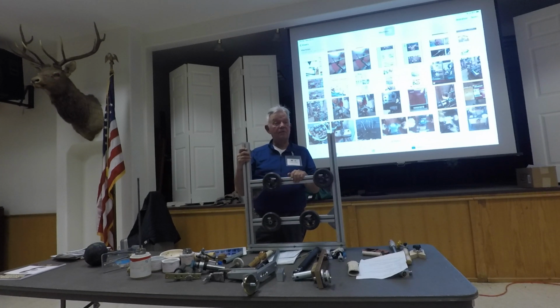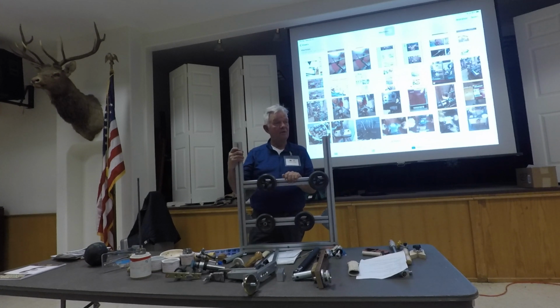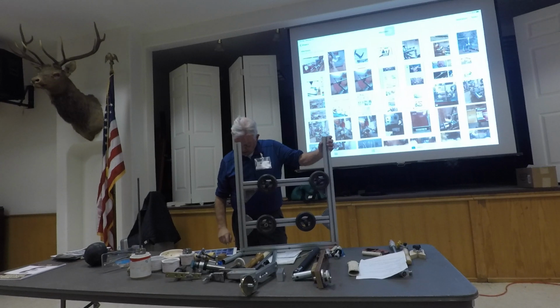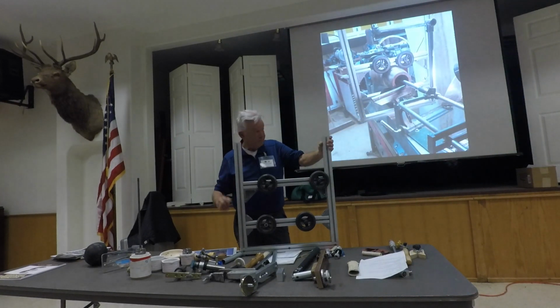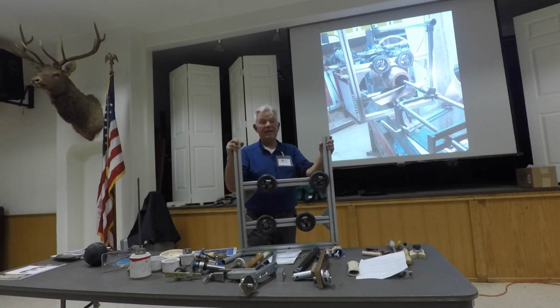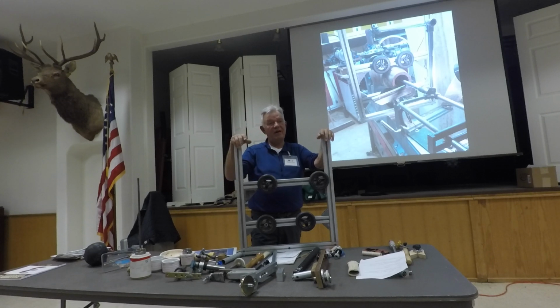But that's basically what a steady rest is. And the thing about a steady rest is that you can... there we go. This is that setup, doing one of the deep bases that I've brought. They're a little bit laborious to set up, but once you set it up, you use the thing in that position for hours, so it's not like you keep messing around with it.